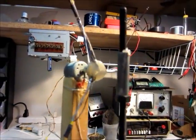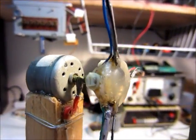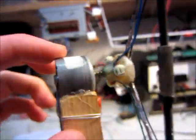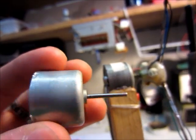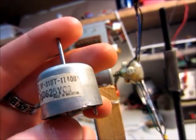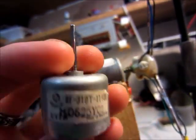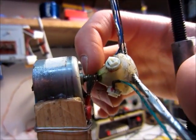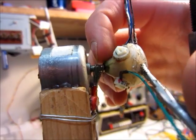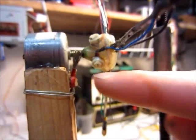I call this the spinner head - I'm not really sure what the real name is for it. We have a motor; it's the same exact kind as this one, which has a three-quarters inch long shaft. I think it's a nine-volt motor from a CD player - the motor that spins the disc. On the shaft I have a plastic tube put on the shaft, and then on the plastic tube I have a piece of antenna tube, and the brush rubs against that.